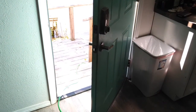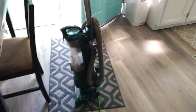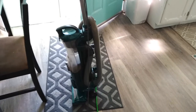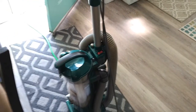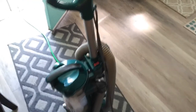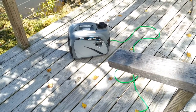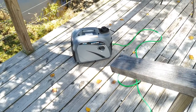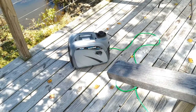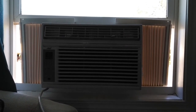In economy mode, after about seven minutes of running, we'll try the vacuum cleaner. It's working — out here you can see it revved back up to non-economy mode to handle the power output. It handled the load without overloading at all. The vacuum cleaner drew 1,200 watts.